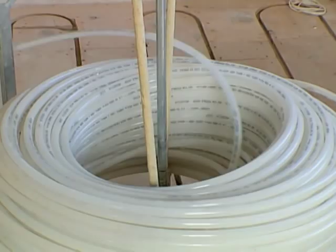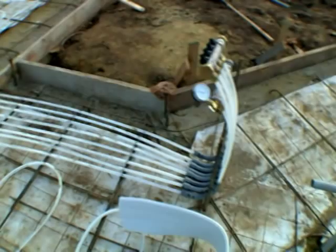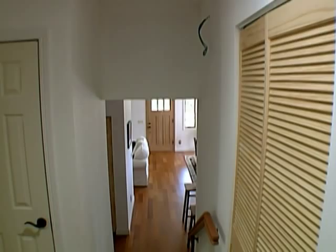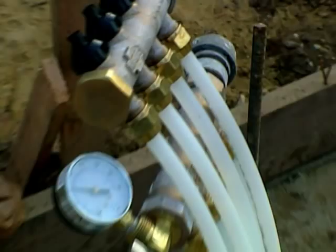Having finished our first floor, we have to turn our attention to the second, where for now we just have plywood sheeting. If we really wanted to be green, we'd leave it just that way, but we want to add something nicer — and we have to add our tubing for our heating system. Hydronic, or radiant floor heating, works by embedding special tubing in the plywood subfloor. Heated water flows through the tubing, warming the thermal mass of the floor. The tubing runs can be up to 300 feet — no joints and no leaks. Conventional forced air systems produce uneven heat with the highest temperature near the ceiling, while hydronic heating puts the heat in the floor under your feet, gently warming a room. Each tubing run is attached to a manifold that regulates each specific zone within the home.